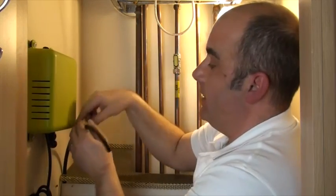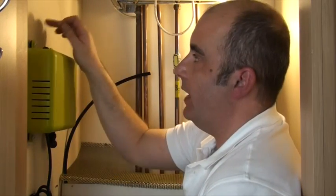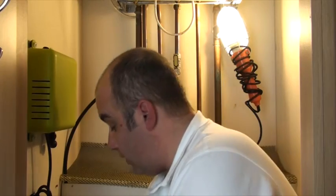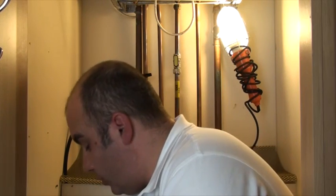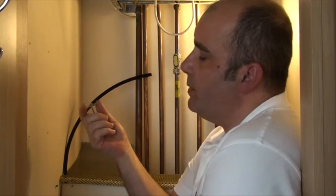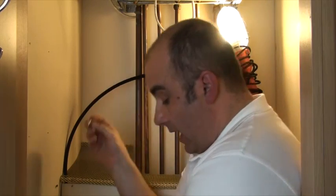Now to connect up the pipe. However, as I said, we've used screws into this hollow wall and some parts are quite hollow. Because there will be vibration, I don't want the unit coming off the wall, so we'll use butterfly bolts instead. We've taken Flow back off the wall — I wouldn't be happy just using screws on a hollow wall. These butterfly bolts go into the wall folded up, and they require a particular size of drill bit.